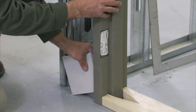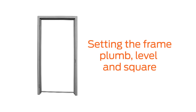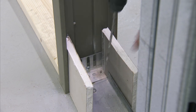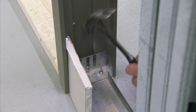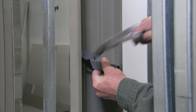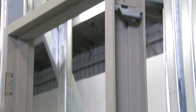Make sure the frame is positioned to allow for the thickness of the drywall. Anchor the base anchors to the floor on each jamb using a concrete screw or drive pin type anchor. In this application, we are using a drive pin anchor. Install a minimum of six anchors — place three on the hinge jamb and three on the strike jamb.